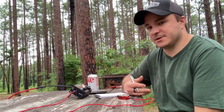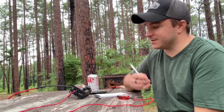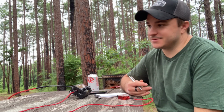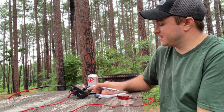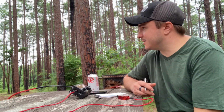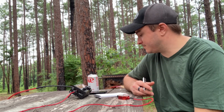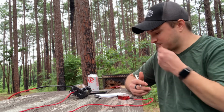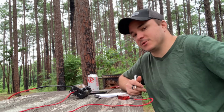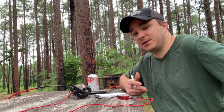I'll call CQ a couple more times here, and if I don't get anything, I'm gonna roll up to 20 meters. It's one of the good things about the MPAS Lite. There's no adjusting. It's not a resonant antenna. I mean, it kind of is, but it's because of a broadband transformer, so it is rather lossy. But just mash the ATU button, change bands wherever you want. It's an antenna for convenience is what it is, not necessarily performance. But it does work. I'll give it that.